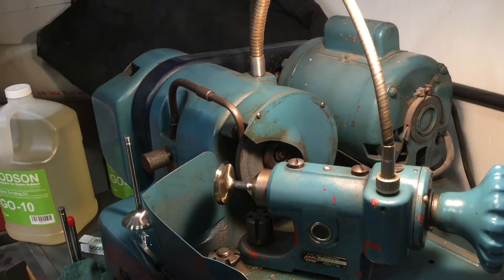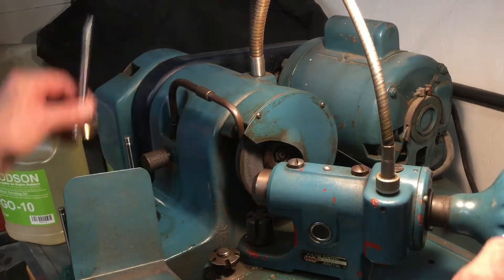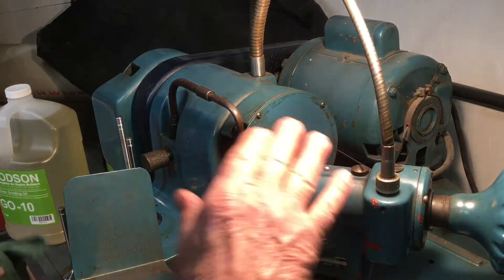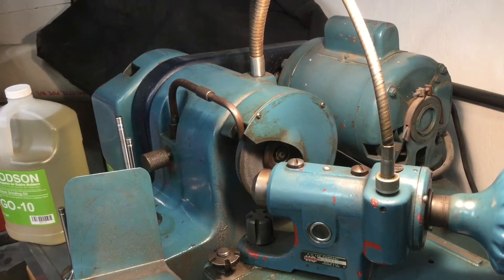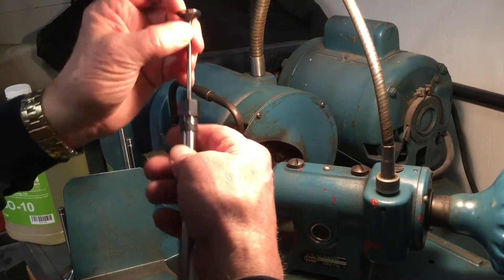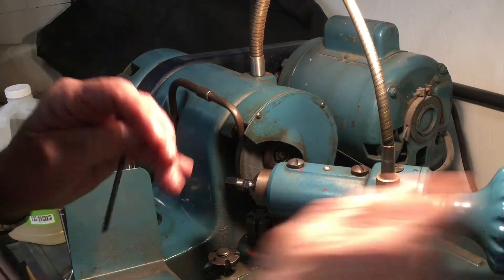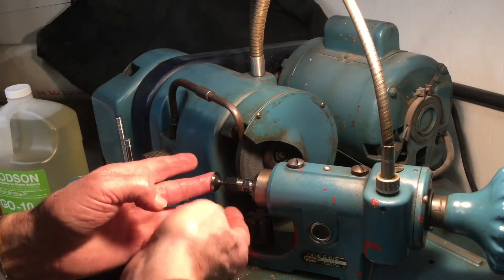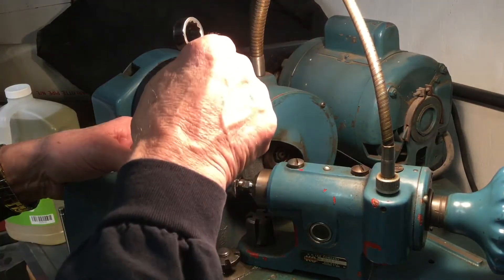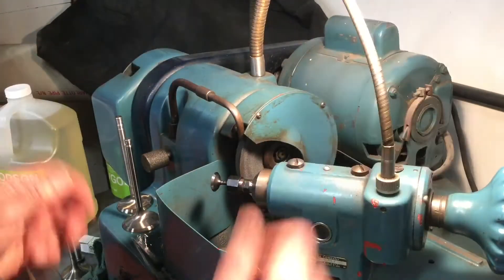I've just finished grinding a regular Chevrolet valve and backed off the stone. Now to go through the process: take out the regular valve, adjust the depth stop on this chuck as I mentioned. I've already got my depth stop set, so I know how far the valve will go in. I'll seat it to the correct depth, tighten up the chuck, load the small valve in, tighten by finger first, then use a wrench to put a little tension on that collet. Make sure all safety guards are in place and safety glasses on before turning the machine back on.